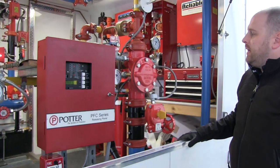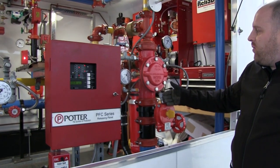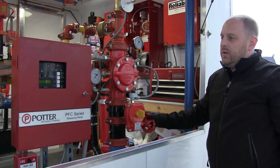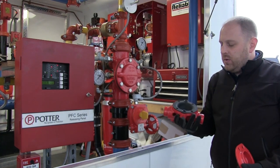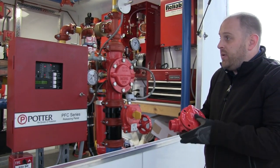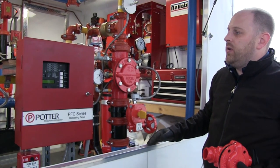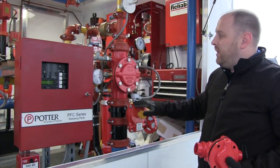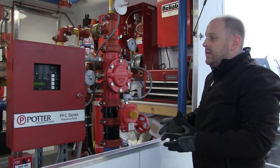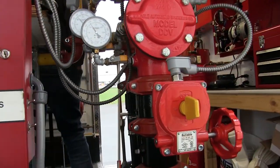The panel goes into alarm and the water begins to drain out of the control chamber, deflating the diaphragm and allowing water to flow through the valve. When we're in a flow condition with the DDV, one of the things we can do is turn the main control valve off to stop the water flow. But a diaphragm-based valve naturally wants to be closed. So these valves have the capability to be remotely reset. By resetting the alarm panel, we have the option to close down the solenoid and begin to reinflate that diaphragm. Your water pressures begin to rise and when they equalize the valve stops. So this valve, while it can do regular deluge operations, it has the ability to be remotely reset if you purchase the right trim and have the right installation.